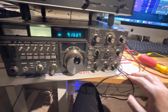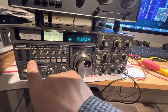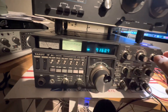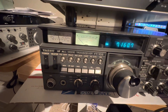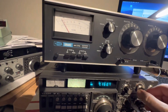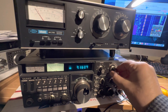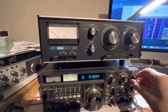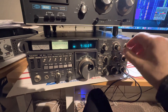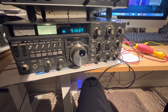Pre-select — you peak that first. I'm going to go to low drive here, transmit, and pre-select. There's a plate current there, a little bit of drive. You want to peak this for some plate, and there's some power coming out. Dip it a bit with the plate — it's got kind of a broad dip to it. Punch it — about 90 watts out, lots of plate current. That's 40 meters.